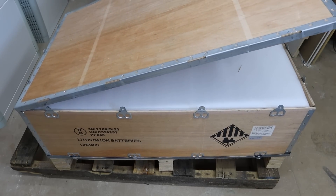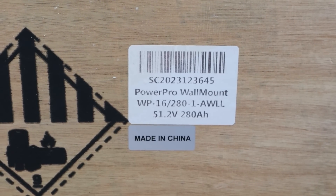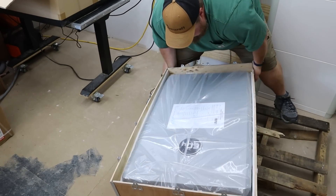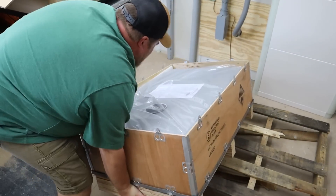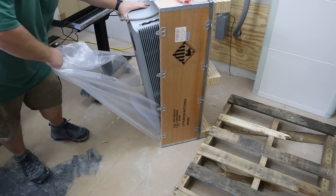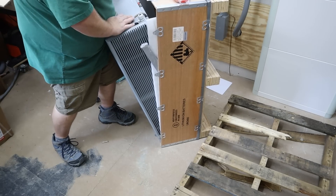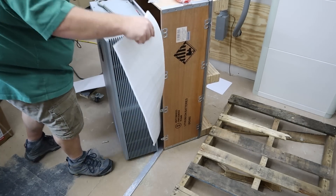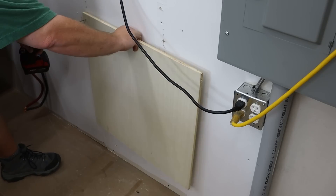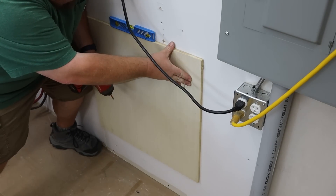To break things down and make it super simple, here are the basic steps for installing this unit. First and foremost make sure you have your location picked out — make sure you have a wall that can handle the weight, a floor structure that can handle the weight, and that you have enough clearance left, right, above, and in front of the unit. I'm installing this one here in a storage building. The walls are eight feet tall so it fits very well, walls are 16 inch on center regular two by four studs and a plywood floor. While the things are heavy they are not overly heavy where you need to be super concerned about your wall or floor holding it, so long as you've got an okay structure. Once you have your location picked out the first thing you want to do is open up and install that mounting bracket that mounts to the wall.